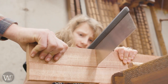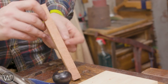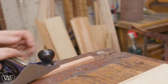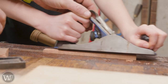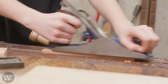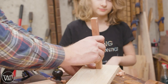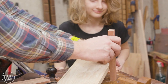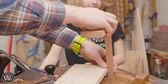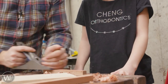The saw wasn't quite deep enough to make the cut all the way down, so I had to snap it a little bit, but oh well. Once we get these cut off, we're going to plane them down to get rid of the saw marks. Because the saw went a little off track on one side, we had to tilt the plane in order to plane it level — another skill to learn. We also teach keeping the force on the toe of the plane when starting, and on the heel when finishing. Now we're getting an idea of how big this will actually be. Do we want to make any changes? How will this come together?